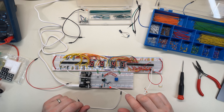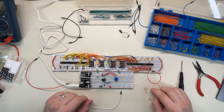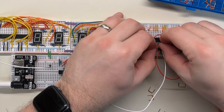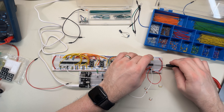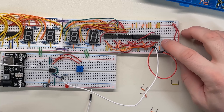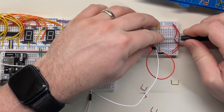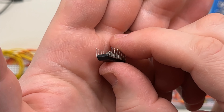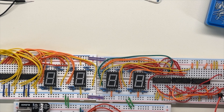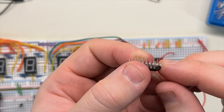Okay, already it's odd and it's still counting wrong. Wait, it stopped counting entirely. What is going on? This chip when it was here worked fine. Did something get unplugged? Maybe one of these wires is wrong. I'm going to switch it back — wait a second. You can't see it but this ground pin is in fact folded up. I wonder how it worked at all. This is the same pin that was bent a little on the other chip before, but not this badly. I wonder if there's something off about this hole on this breadboard causing the pin to divert when I put it in.